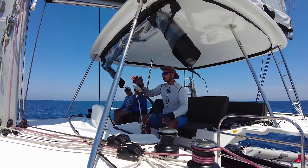So what we did is, we opened the main a lot, actually too much, put in the shrouds. You can do this only for a short amount of time or shouldn't do it at all. Then we tensioned the black line, the blue one actually, and then we tensioned the main sheet. And that's how we keep the boom more open without the sail going to the shrouds. So this is like a vang and also a preventer in case we mess it up, so that the boom doesn't go across to the other side, which would cause a lot of forces and wear and tear, potentially losing the mast.